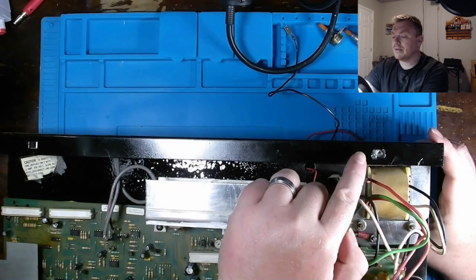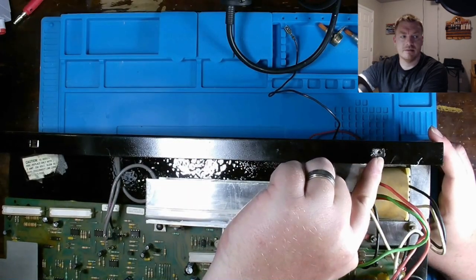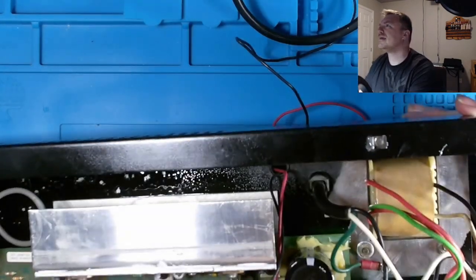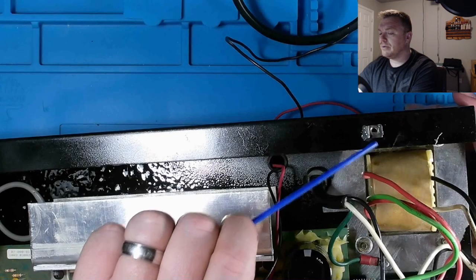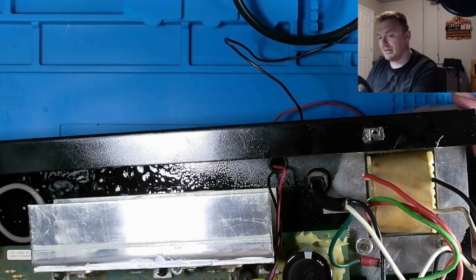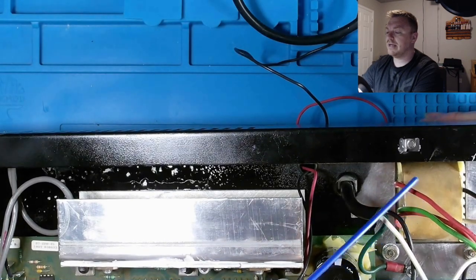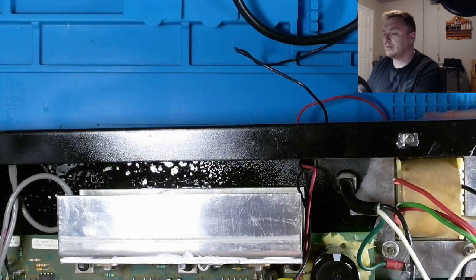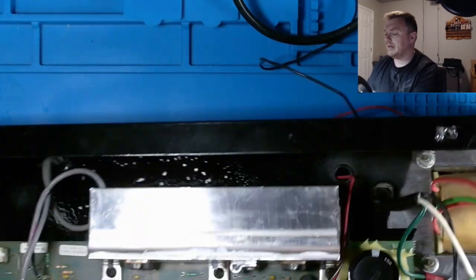Now that super glue is dried, I've taken a two-part epoxy JB Weld, put it over the top of that end, and then inside this area right in here, maybe I can zoom in a bit. Just inside of the nut and down in there, I went ahead and put a little bit more JB Weld, as well as underneath the retainer and in between the retainer and the chassis. And hopefully that JB Weld works well enough and will hold. Now, I'm not planning to over tighten this screw once it's set back in, but at least that screw will be in there and hopefully provide some retention to get this to sit right inside the housing.